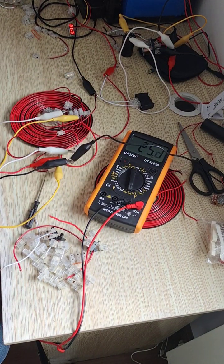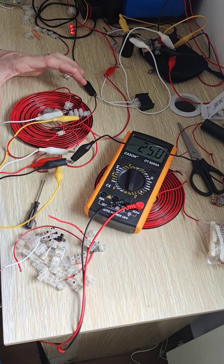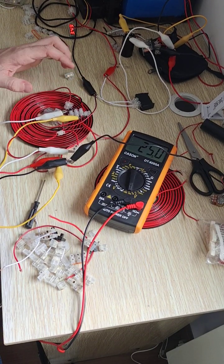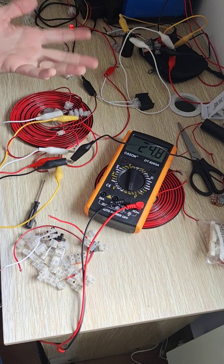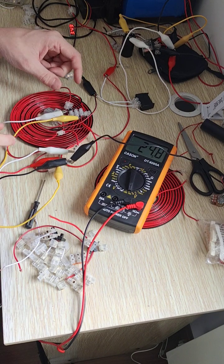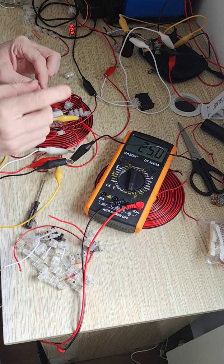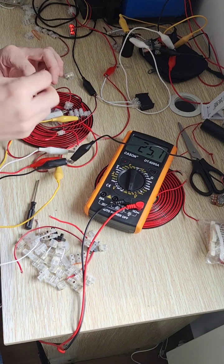This video has been far too long. But just to show how we connect the two coils on either side of the main coil, the possibility of opposing, and how to connect them as well. And I want to start looking at connecting them in parallel, so connecting all the outside wires together and the inside wires together, rather than connecting them in series where you go from the outside to the inside, outside to the inside.